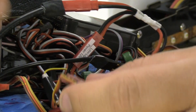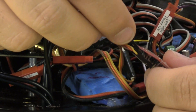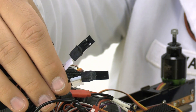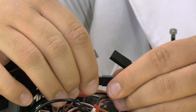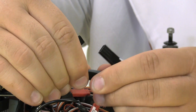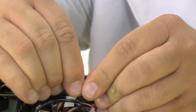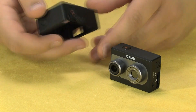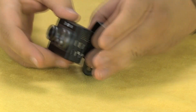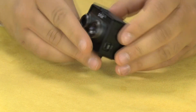I'm going to hook my camera switch up to the cable I made here. I'm going to connect my PWMs from the FLIR to a couple of cables from my receiver. This will allow me to start and stop and change video modes. I'm going to mount the FLIR physically to Raven using a standard GoPro 3 frame mount. It actually fits perfectly inside and the buttons all line up — like it was made for it.